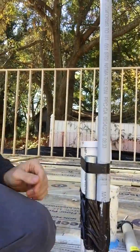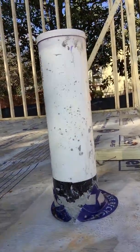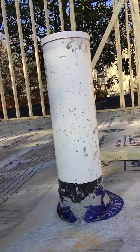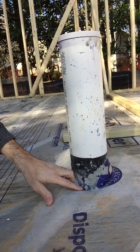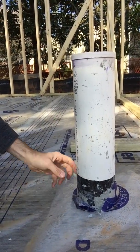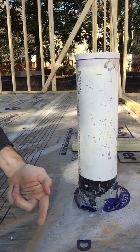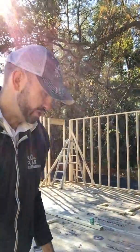We have a black Pango wrap that is our vapor barrier and termite barrier. You can see it on this pipe coming up — this is a toilet drain here. The tape and the Pango wrap are coming up through the slab, several inches above the slab. This continues underneath the entire slab. It's a 15-mil vapor barrier and it'll prevent moisture and termites from getting up into the house.